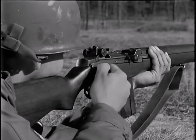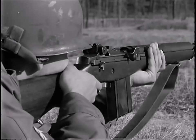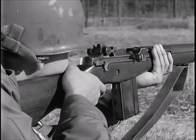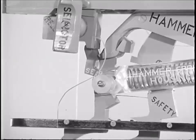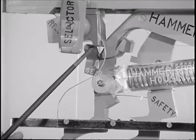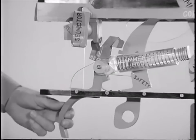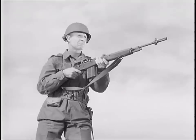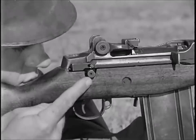M14 rifles equipped for full automatic fire have a selector marked 'A'. To fire full automatic, the rifleman turns the selector so that the letter A faces him. By pressing in on the selector and giving it half a turn so that the letter A is away from him, he sets it for semi-automatic fire. When turning the selector to semi-automatic, the movement rotates the sear release forward on an eccentric shaft approximately one-eighth of an inch so that it cannot trip the sear. It also causes the connector assembly to move far enough forward so there is no contact between the operating rod and the hook of the connector assembly, positioning the sear release so it cannot contact the sear. At the discretion of the unit commander, the M14 rifle may be issued to troops either with the selector or with a selector lock which permits only semi-automatic fire.